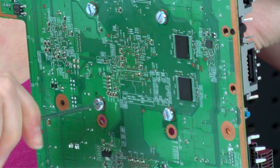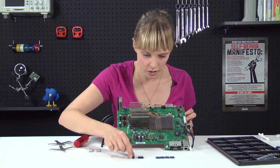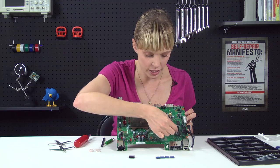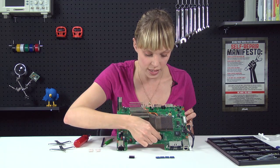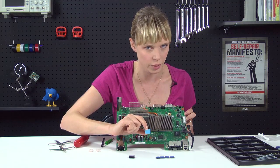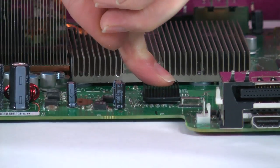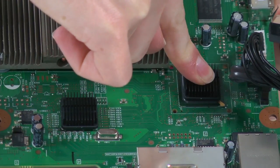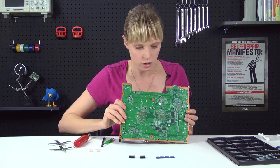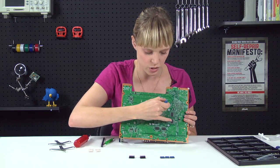The last things we need to add are these two heat sinks — we're going to attach one here and one here. It's important that you get these exactly in the right spot the first time, because the adhesive is really strong, and once you put them on, they're not coming off. Also, you want to make sure that the fins are parallel to the fins on the existing heat sinks. Once those are on, on the other side, you're going to attach these four thermal pads to these four chips here.